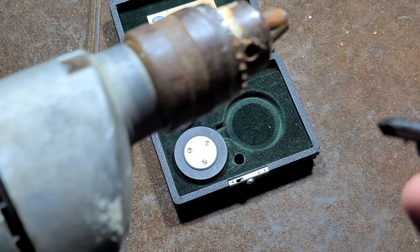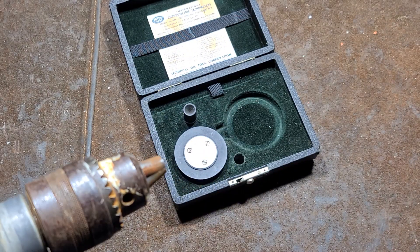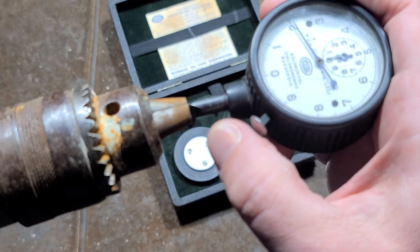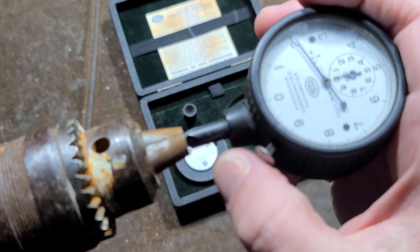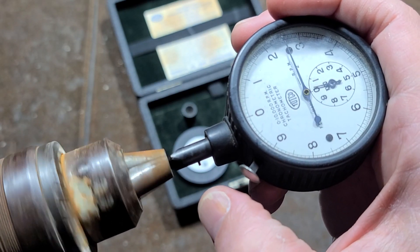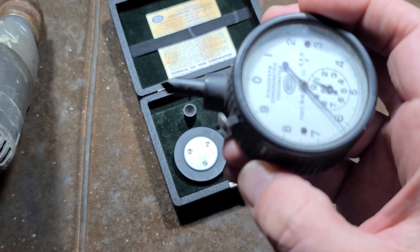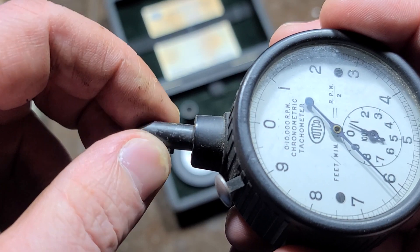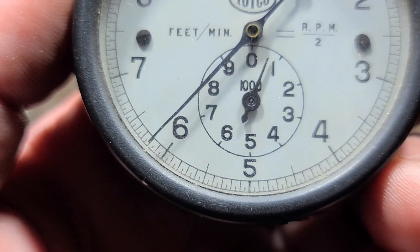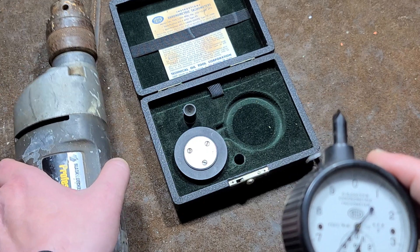What I'm going to try here — and there will be a video soon — is this old Black and Decker that I paid five bucks for. It's a half-inch hole gun rated at 600 RPM, made in the USA. This is the last of the professional-grade Black and Decker branded drills before they went with DeWalt. You'd run the drill, get it up to speed, then press the button. We got an exact reading of 620 RPM, proving we're in the ballpark for both the gauge and the label-advertised RPM of the drill.